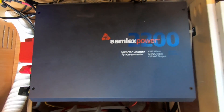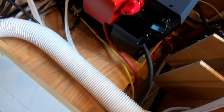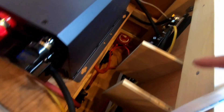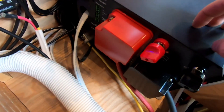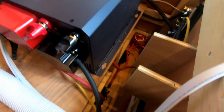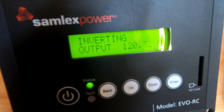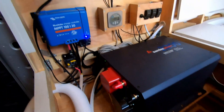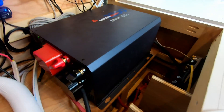I just got this Samlex inverter charger hooked up. It is quite a beefy boy. It's hooked directly to the batteries with three wires: a negative wire that goes to the negative bus bar, a positive wire that goes into a 200 amp fuse and into the positive bus bar, and then an additional ground wire hooked directly to the chassis in case there are any ground faults to prevent massive fires. So it works — moment of truth. If I turn it on, it outputs 120 volts AC. It is a little noisy — I wasn't expecting it to make this much noise — but it'll power all the stuff I need it to, so at the end of the day it's probably worth it.